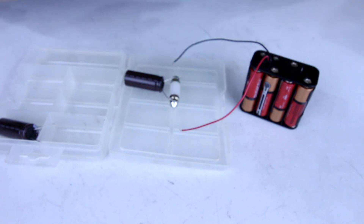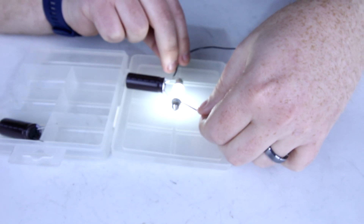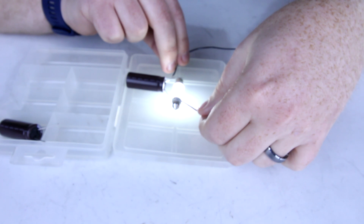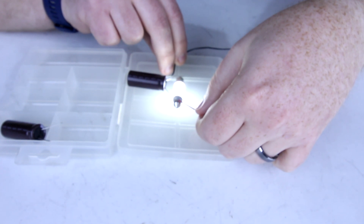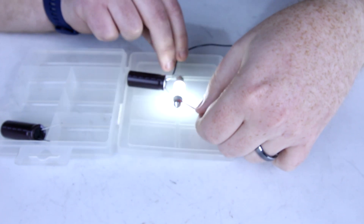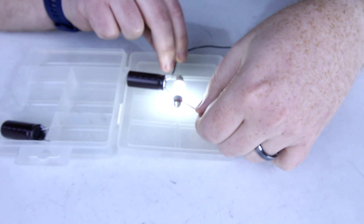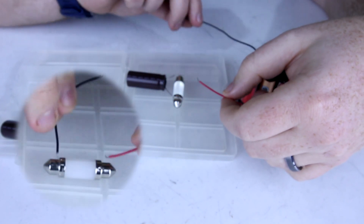Let's do everything at the same time now. What's happening here is that I'm charging up the capacitor and lighting the bulb up at the same time — I've got the capacitor and the LED in parallel. I'm able to light up the LED and charge the capacitor at the same time with the same battery bank. Now if I disconnect the battery, the capacitor still has power to give to the LED. That means if I'm bouncing up and down off of the wire, the LED still lights up and it doesn't flicker on and off like if we didn't have that capacitor there.